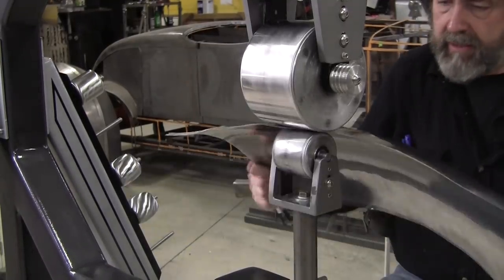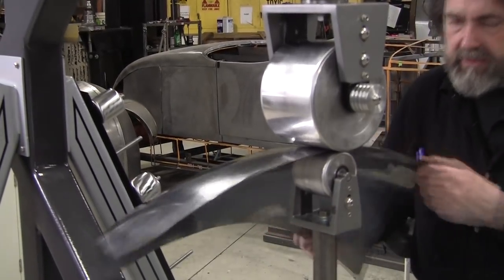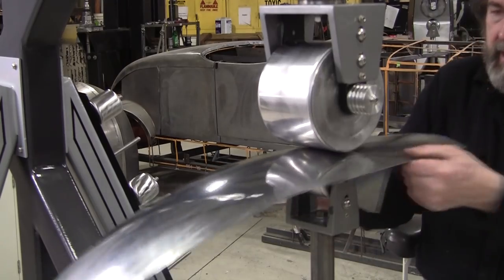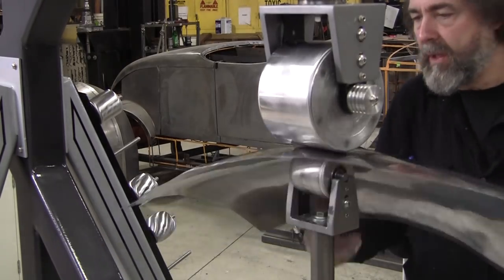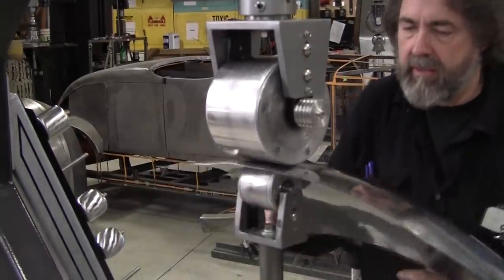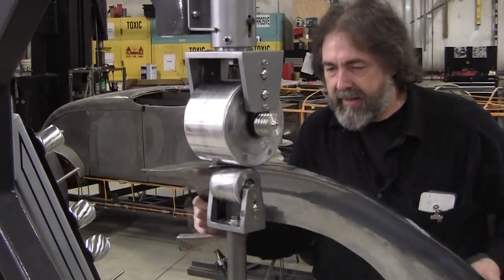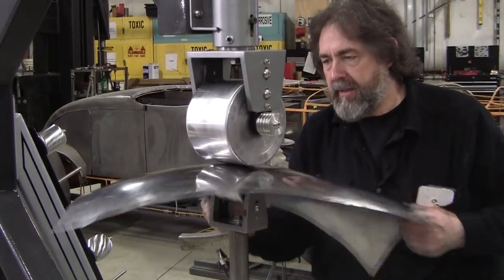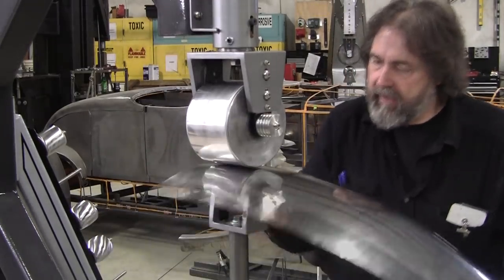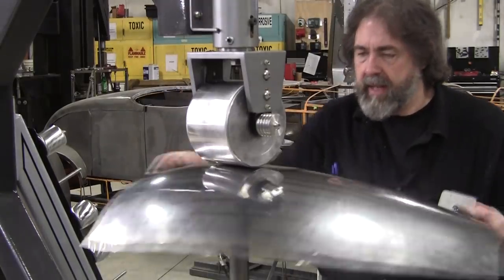Back in the 60s when I was working at my grandfather's restoration shop, we first were painting all the cars, and these were Packards and Duesenbergs and Rolls Royces and Bentleys. That was his main clientele. And we would use the nitrocellulose lacquer, and I still believe that that yields the nicest looking paint job ever. That really deep shine on nitrocellulose lacquer, but put it out in the sun for 30 days and it loses its luster. It potentially has micro cracks. There's all kinds of problems that happen with it.